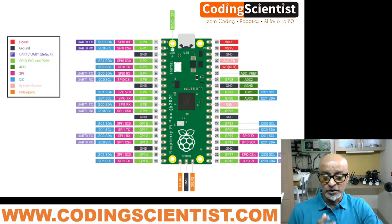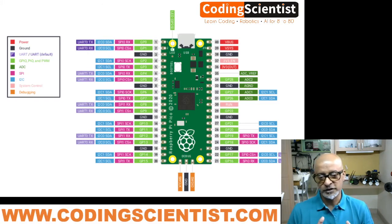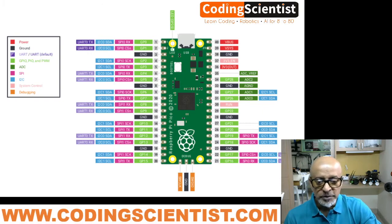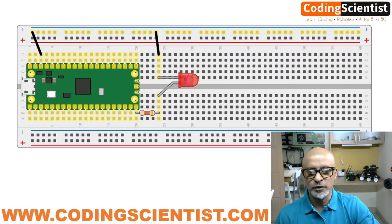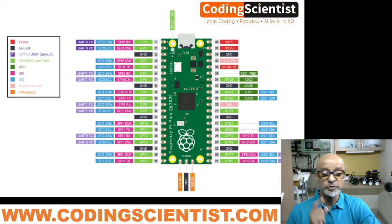80 to 90% of the projects will be using only these green pins, unless we are doing some remote control activities and projects, which is going to be at a later stage. We will be accessing other pins as well. I'll show you step by step. So for now, GP pin, right? This is the pin as per this circuit. If you look at this particular circuit drawing, you will understand where the resistor is connected to the LED. So that is pin number GP15, which is your physical pin 20. I hope this is clear, guys.